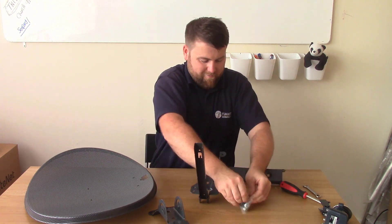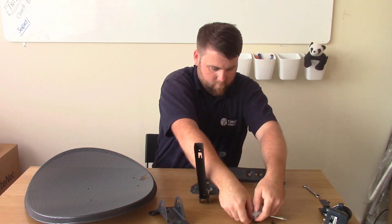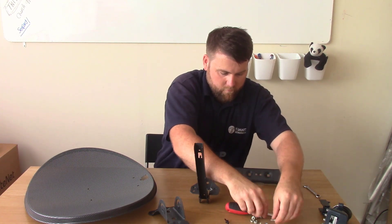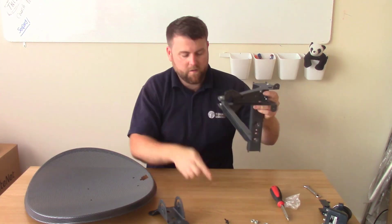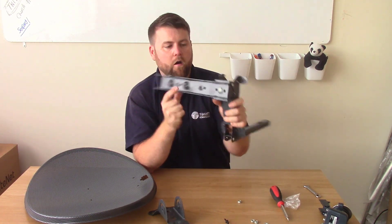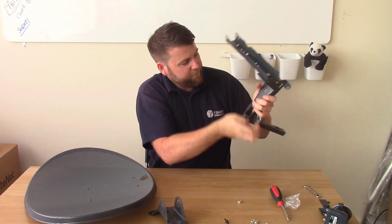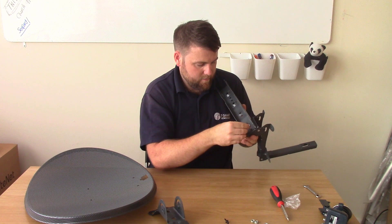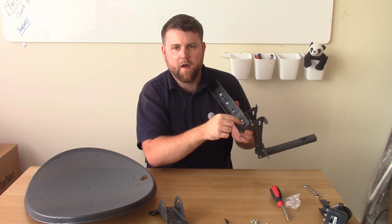So we're going to open our bolts. We've got four screws - like I said, four bolts and four nuts. And there's another one here as well, it's already in there. So we're going to feed this through. Whichever way you choose to put this arm, go onto the end one - don't go onto this one, go onto that one. We don't need to take that one out. Feed it through the other way, so feed it through backwards. And then put the nut that side. It just makes it so much easier to tighten up. And if you ever need to flip it around the other way, you've only got to pop that nut off and the whole arm will flip around.